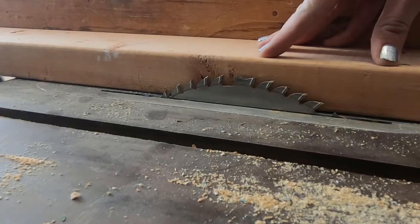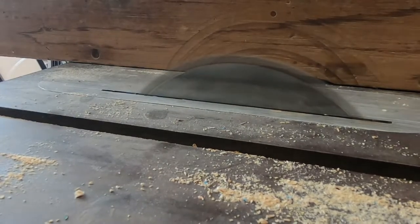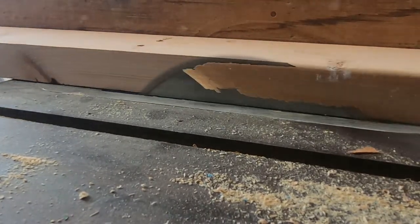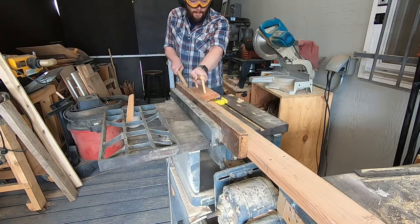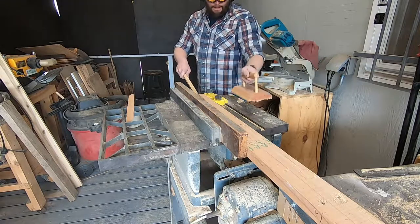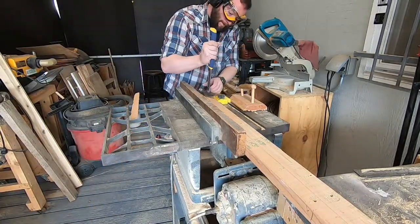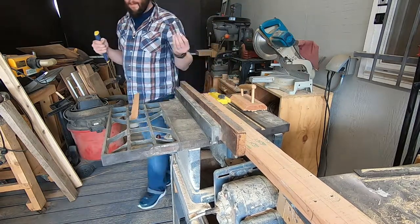I've never liked the way 2x4 lumber looks with the rounded corners, so I decided to rip this down to get nice square edges. By the way, if you haven't seen my video yet on why I only raise the saw blade just above the wood I'm cutting, check out my catalog of videos. In a moment I noticed there's a nail I missed — it's a good reminder to always be paying attention and present in the shop whether you're working with reclaimed or brand new materials. No biggie, I just turned off the saw and pulled it out, but it sets the stage for an important reminder about safety. Watch for the head of the nail when it breaks off and goes flying — I didn't even see it happen, so there's no way human reflexes would be enough if it came towards my face. Make sure you're wearing eye protection even when using hand tools.